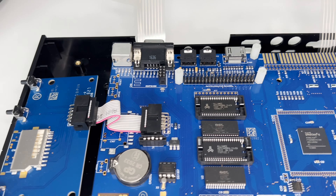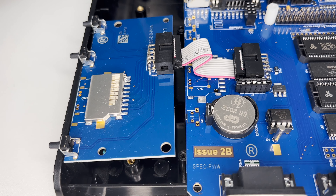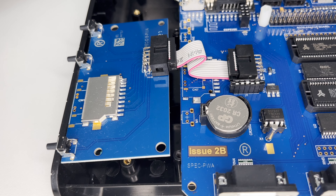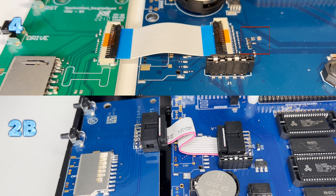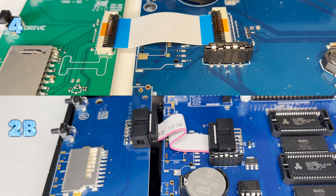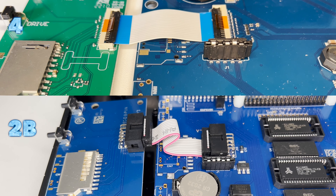Next, we switch over to the daughterboard, which was another one of the big three EMI hitters. As shown in a previous video comparing Issue 3 and 4, the ribbon cable connecting the main board to the daughterboard is a significant source of electromagnetic interference, due to the large loop areas in the cable caused by the separation of signals, ground, and voltage sources. Improvements made include: addition of a 3.3 volt supply filter, ESD protection diodes, and capacitance to reduce conducted EMI. The ribbon cable has been changed to a ZIF cable with 16 lanes that can alternate signals and grounds to reduce loop area. Digital noise rejection for long button presses was already in the FPGA for Issue 2, and analog noise rejection was also added for Issues 3 and 4.